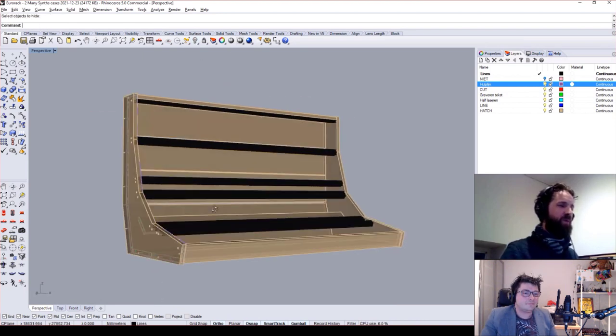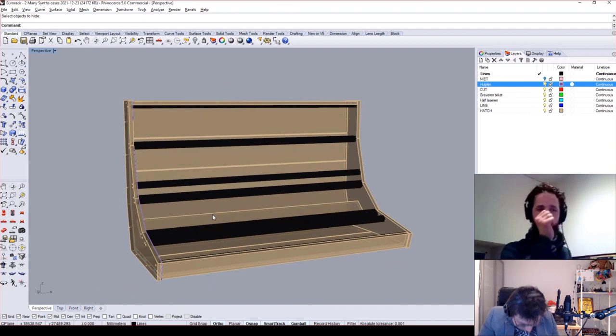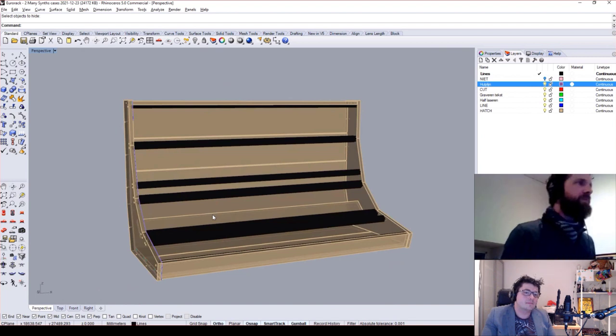So power-wise, first of all, you have to do your homework. So, ModularGrid: make a rough planning. Don't look at the cost of everything at the bottom because that's frustrating, but especially look at your power demands. Based on that, we're going to determine how many PSUs you have. I work with the Meanwells because they're budget friendly but still strong power supplies.